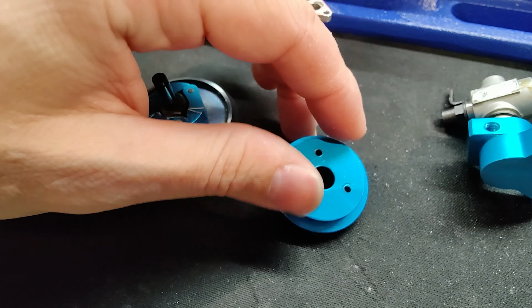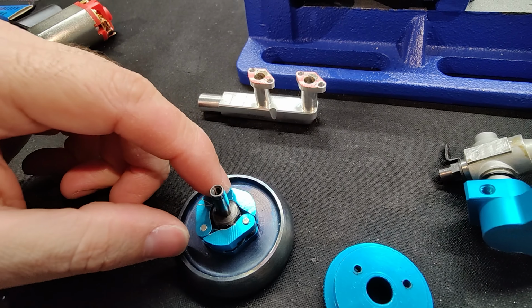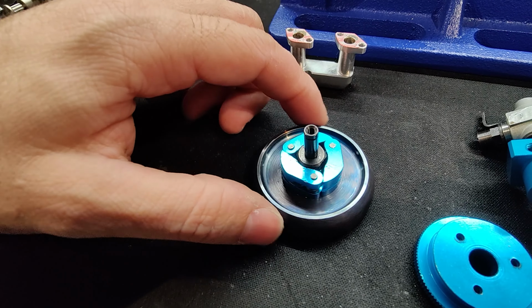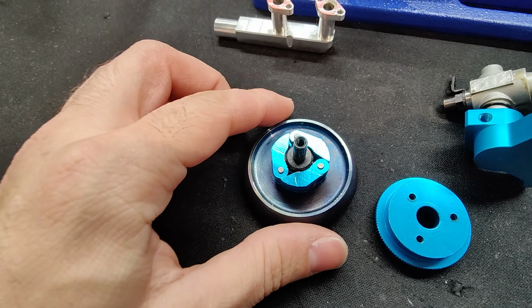It's like a kit. It comes with the flywheel, the pins, the clutch shoes, and the springs for the clutch shoes. So it actually was perfect. It was the same exact diameter as the holes that are pre-made in this flywheel. I literally just got one of my bench vises, and I sandwiched this in between with the pin on the other side, and just slowly pushed the pin in, and it went in fairly easy, but tight enough that it is not going to come out. Obviously, it looks like they already designed this to have pins pressed in there, so that actually fits perfect.